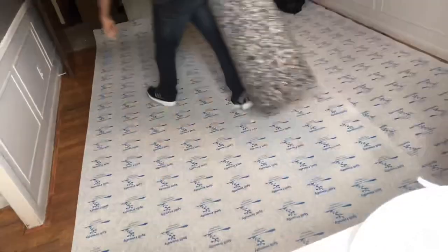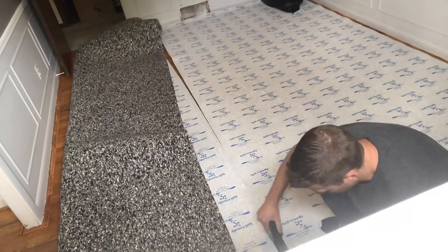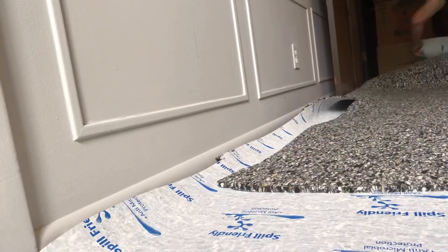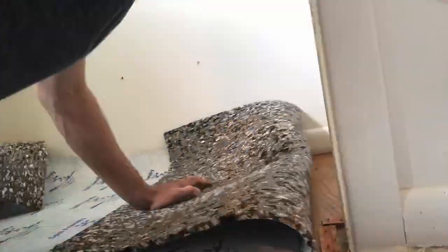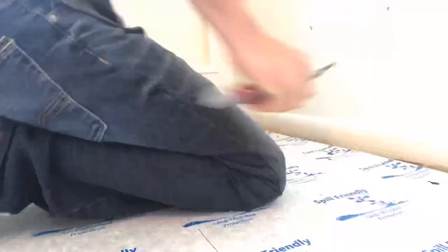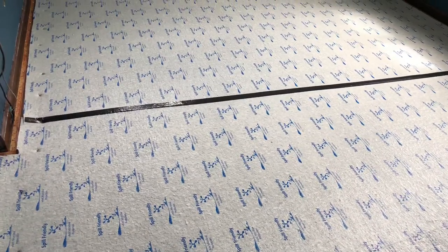We're going to trim that in — just like I said, the hairline gap from the tack strip. Even though that looked like it was four inches back, that was just a bad camera view — wasn't my mess up. Now we're going to tape that seam. Life is good. Now it's time to start cutting around the walls — just rough cut everything in. Remember, if you cut it short don't worry, you can always patch it in. Work our way around the room, staple staple staple. Look at that final product — you're ready to drag in the carpet and start stretching.